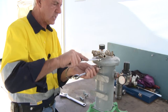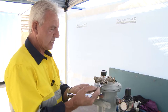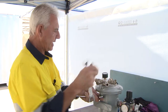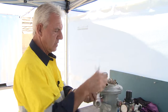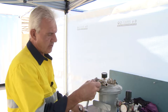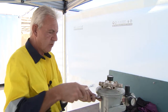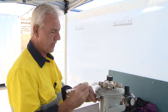This unit has six outlets, and it's important to keep them clean. If you're going to store it, get a plastic cap that fits over the fittings, or alternatively tape them up. When in an abrasive environment, blow these fittings out — especially around the edge — because the return clips have ball bearings and a spring in them, and grit can build up within those fittings.